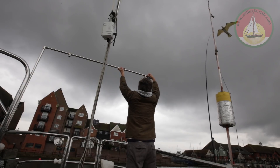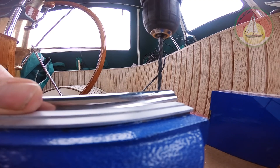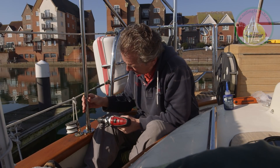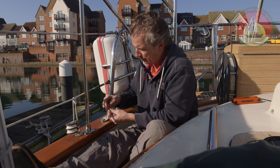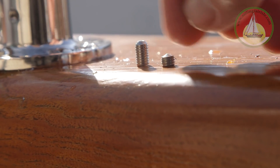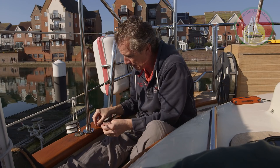That means not just relying on grub screws to hold the stainless steel joints together. I had to mark the position of all the grub screw holes in all the joints and then cross-drill them. Take it from me — you need a good sharp drill bit for this. Because of the windage issue these things could be in tension as well as compression, so I'm drilling a hole straight through so I can put a longer grub screw in. You can buy these longer grub screws. The longer grub screw makes sure the pole can't pull out if it comes under tension with wind underneath.